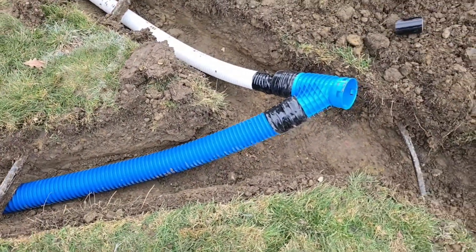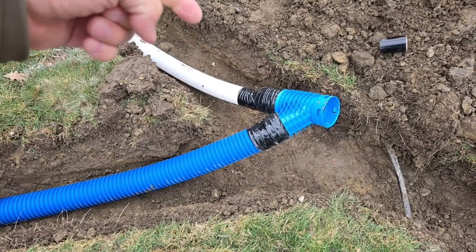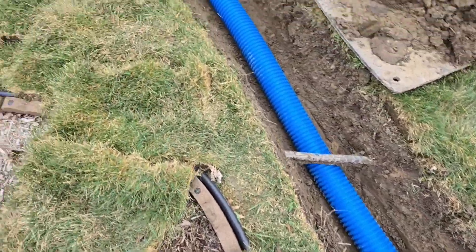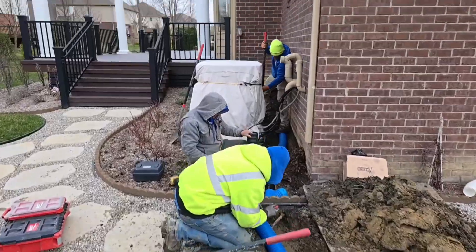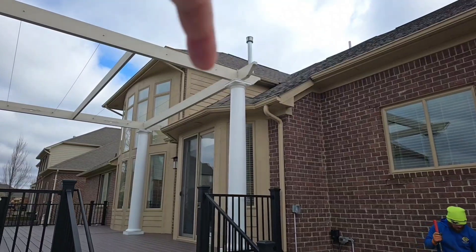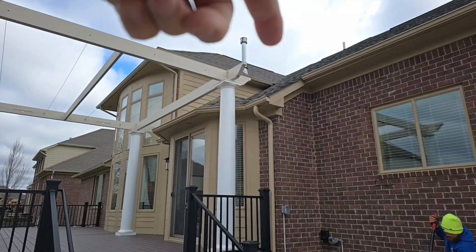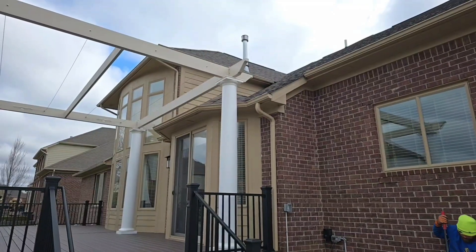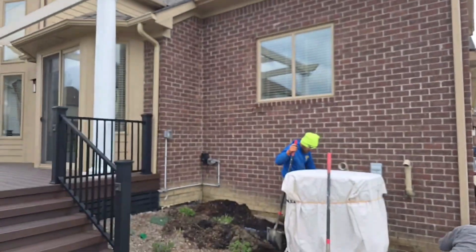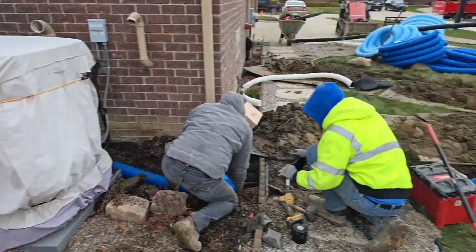They tied it to an extra heavy-duty wye, so that's how you tie a three-inch plus to a four-inch fitting. You have an increaser that goes from three inch to four inch right there. They have a really nice slope on this four-inch line. The reason why they're running four-inch line: over here we have a downspout, all this roof water, and some of that's making it into the valley finding its way over here. We have all this roof on the back of the house — this whole run — so these two are tied together, wyed together, and put on a four-inch main.